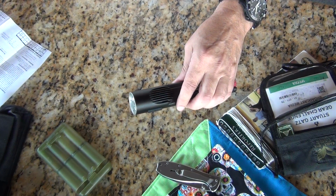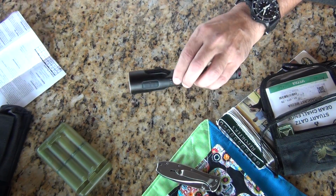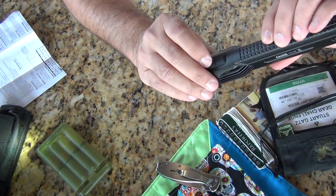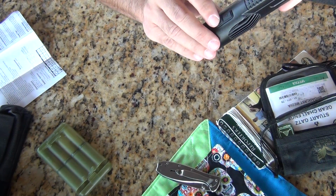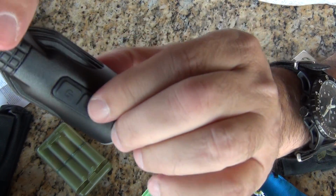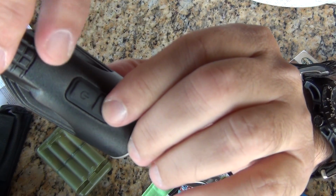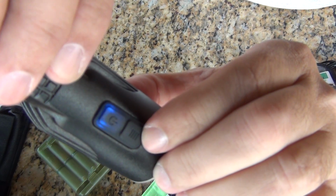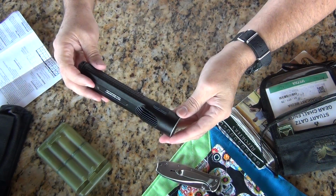Now, I was just reviewing the manual. With the light off, and if you press the selector switch, well, it went right up to its previous mode. Okay, now we found it. So if you take the selector switch and just tap it, underneath the power button, it will blink. 3 times means a minimum of 50% battery remaining. 2 blinks will indicate less than 50%, and so on.